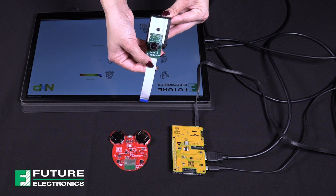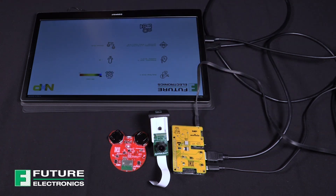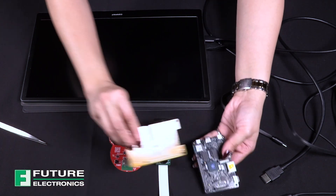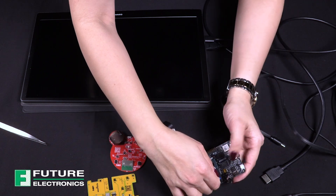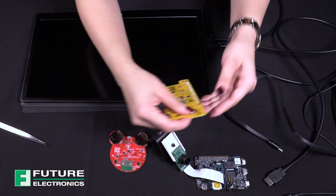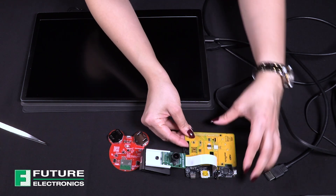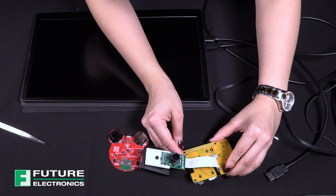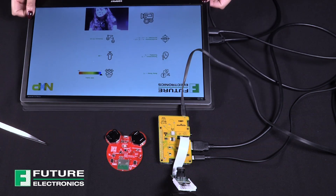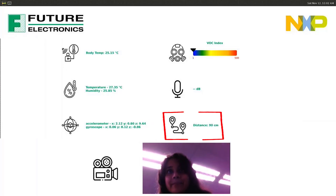Certain Raspberry Pi style cameras can be added to the Goldilocks demonstration platform to extend the demo functionality. All we need is a Digilent PCAM 5C camera. Power off the board first, and it is a lot easier if you remove the honeypot adapter. Slide the MIPI interface lock and take the cable with the blue side facing towards the USB port over here, then slide it into this interface and make sure that the connection is made to the PCAM 5C camera. Now we can reconnect the power cables. And voilà, you should see the camera feed on the GUI.